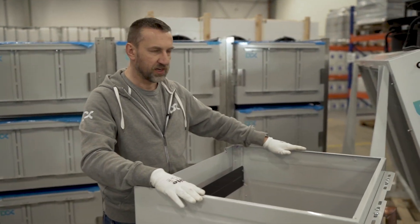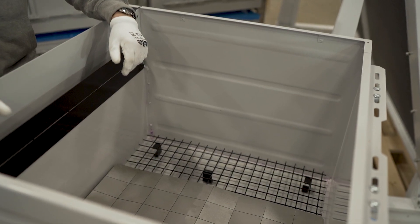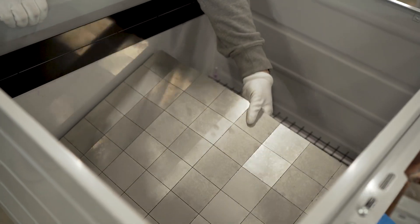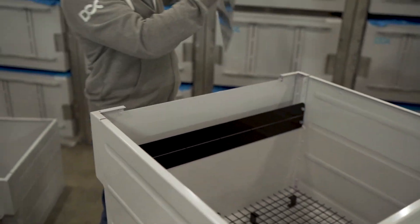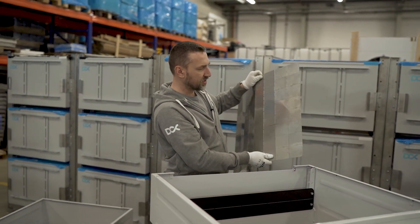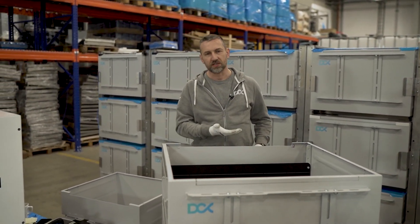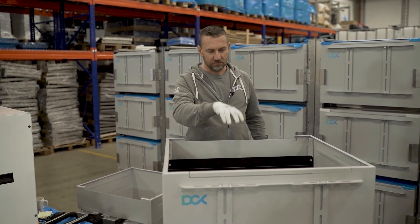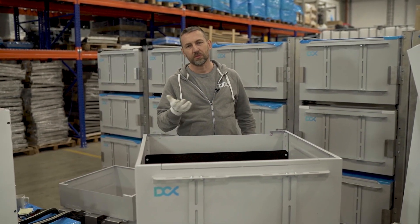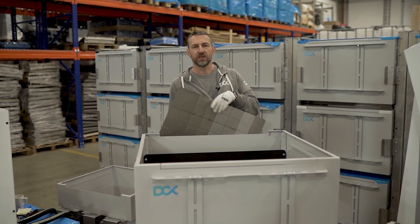Normally there will be a lid, and we suggest using the lid for normal daily operation, along with a few components at the bottom. This is the universal flow director plate - it's all hardware, pretty thick cut. The reason we use that plate is to configure the flow only through the miners which you actually operate. We want to force the flow through the miners and not around them. If you put miners inside the enclosure - one in the middle or three in the middle - most of the flow will go around the miners. So we use that plate to cover the area around the miners.